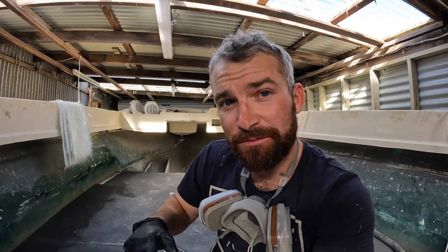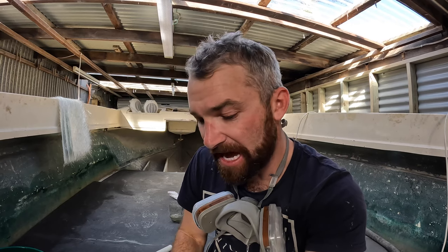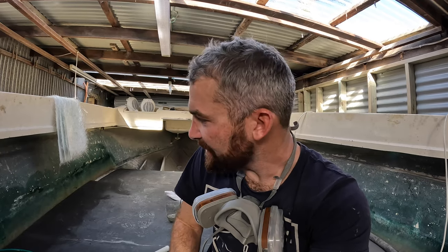In the last episode, we finished gluing down the floor. We've screwed it with 316 stainless screws. I've gone through and replaced all those with a heavier gauge as well, so they're really holding it down nicely. It's glued down with talc and resin. And what I've done is bogged up around the edges where there was any overhang, places like that, with talc